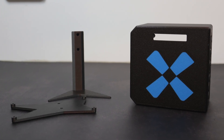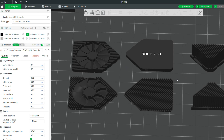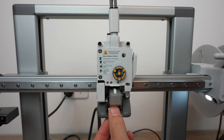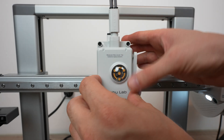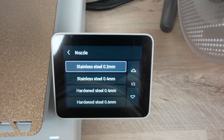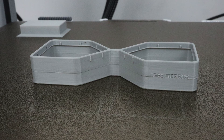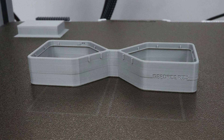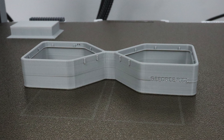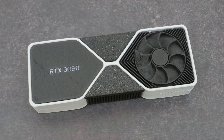With the case and monitor stand complete, we can move on to the graphics card. Because it's so small and I'd like the text to come out, I'm swapping to a 0.2mm nozzle on the A1. This is also an improvement over the P1 and X1 series, which require quite a bit of effort to swap nozzles — the whole hotend on the A1 is held in place by a single clip. It would be great if they could put an RFID tag into the hotend so the printer automatically knows the nozzle size. I really like how the GPU came out. The text on the side is readable, though the white doesn't show up as clearly as I hoped, and there's a slight step where too much filament is extruded. But the text on top is clear and the heatsink fins came out really well. Fully assembled, the GPU looks amazingly detailed for its size.